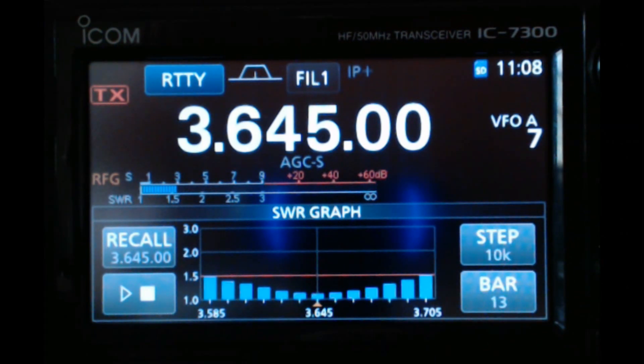I'm right in the middle of where it's resonant on 80 meters, so I'll go ahead and run it. I've got my auto tuner in bypass, so we're going straight through the antenna. I didn't put the antenna up exactly the way they recommended — I didn't have the room. The center is up 20 feet and the ends are approximately 11 feet off the ground. The antenna is 103 feet long, so not ideal, but it's what I could do.